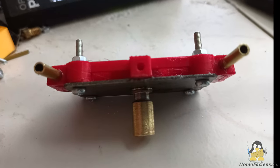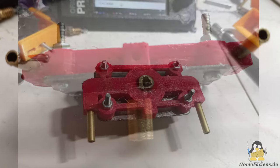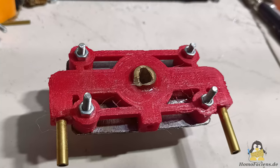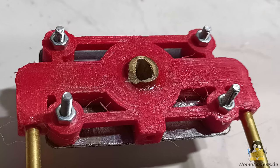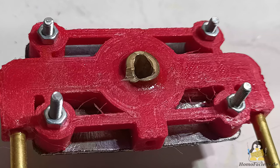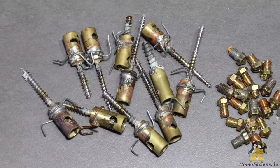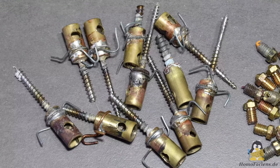Regarding the extruder, I made a new tube. At the upper end I made two notches with a round file that, together with a 3mm cut, improves the entry of the granules into the extruder. I also made and tested several variants of auger screw geometries.